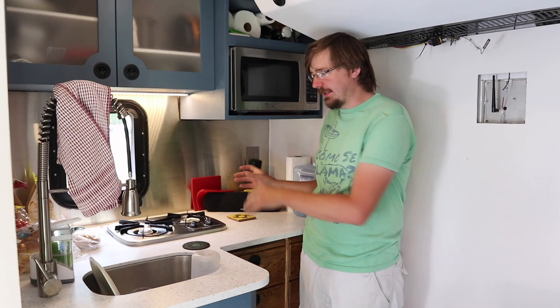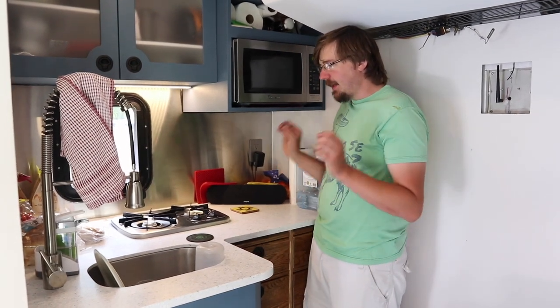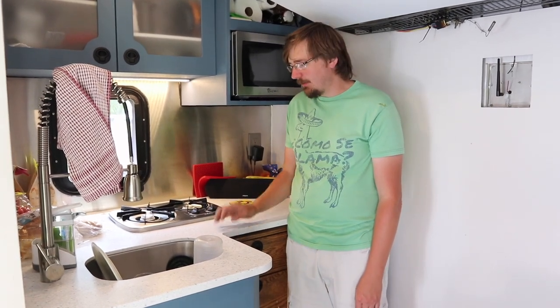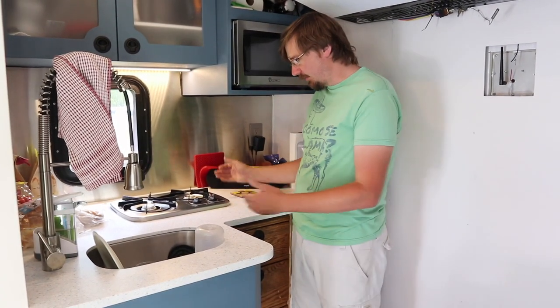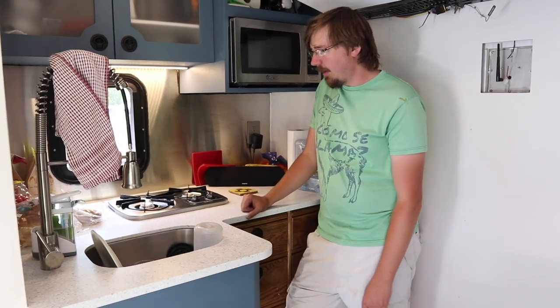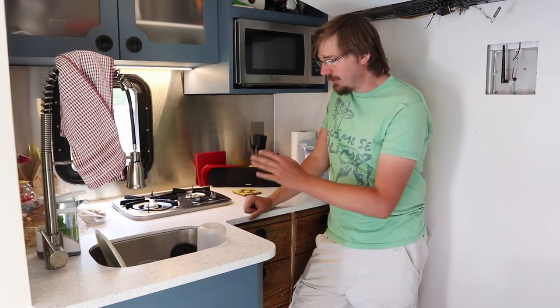This cabinet came with the truck — there was a small office area since it was a mobile tool store with a little desk. I really like this height as a six-foot-two person, so I kept it and built out all the rest of the cabinets at a local maker space. The countertop is Corian — I found an installer on Craigslist with surplus sheets and picked up a single sheet. Fabrication was done with a circular saw and router; you have to get the right glue dispenser to join pieces. It's a fantastic material — nothing stains it and the color goes all the way through, so if you gouge it you can polish it back out.